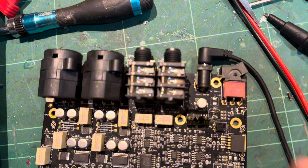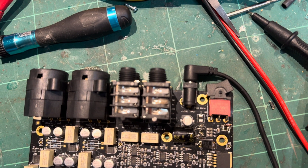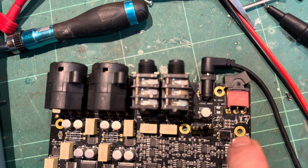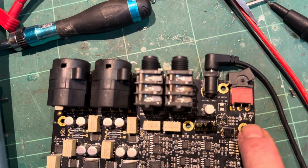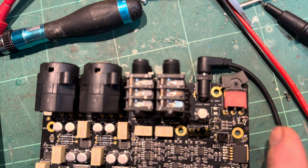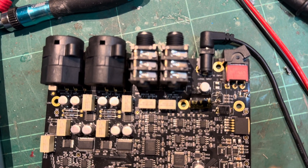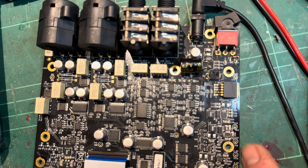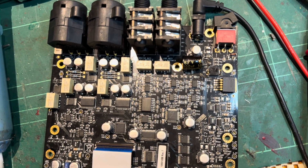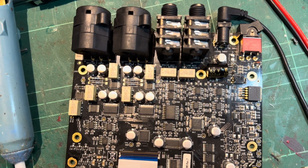There's a little barrier diode here — a little surface mount diode, this little one called an XK96A. I lifted one leg, measured it, and it was short circuit both ways, so that was definitely faulty. Someone's plugged in the wrong power supply or wrong polarity and blown that. So I went and got a standard 100 volt diode, put it in with the cathode — the negative side facing inwards and positive side outwards — and put that in circuit, then plugged in the 12 volt power. Now when I measure the test points they're all showing the correct voltages: 11 volt, 12, 3.3, 5 and so forth — all working.